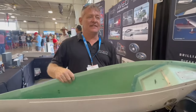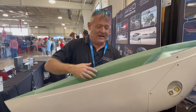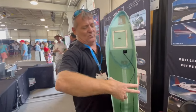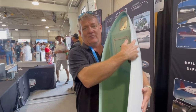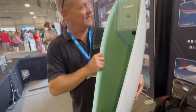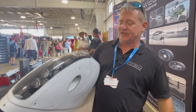We just invested in a 150,000 euro autoclave — a big pressurized oven that sucks every last drop of resin out. We're laminating structural Aerex foam between layers 2 and 3 of the 4-layer laminate, making it way stiffer than a stock tip. Plus, there's a bolt head insert rib where the lights mount, adding additional rigidity over stock. That's the Zip Tip Vegas — I'm already taking deposits at the show, shipping in October. They are $4,450 for the pair, and these are going on my RV-10.